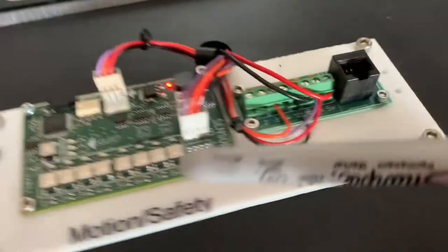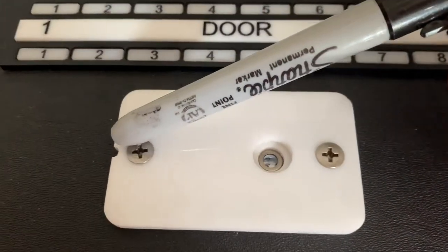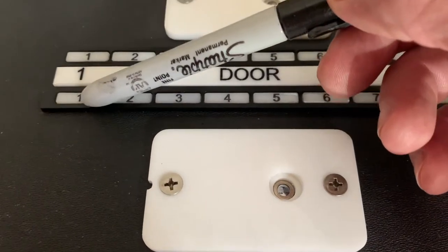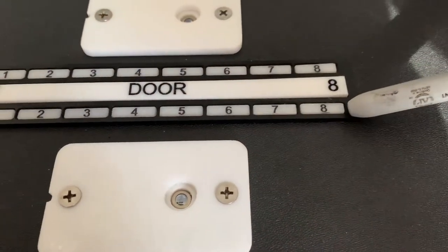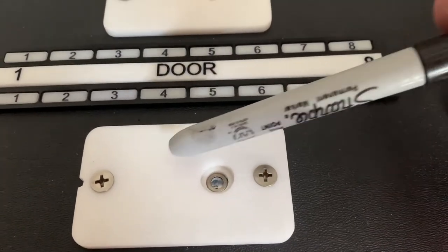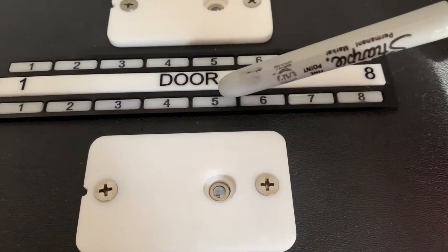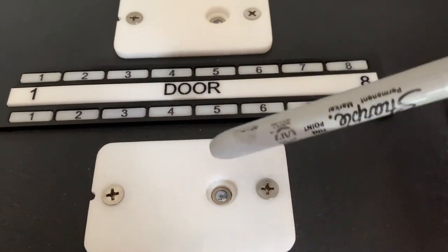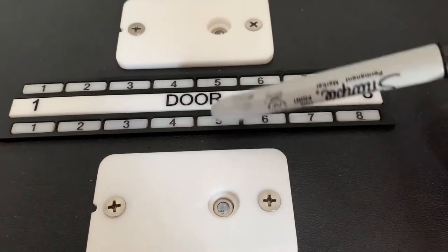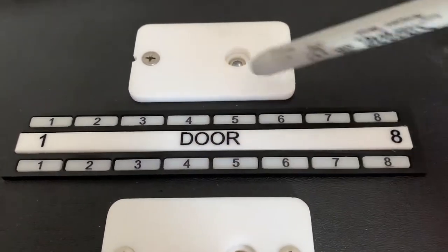The sensors have a notch representing zone 1 through 8. This indicator shows how the sensor looks down at the floor next to the door. If you mounted it in the ceiling about 6 inches away from the door, you'd be detecting pretty close to the surface of the door on both sides.